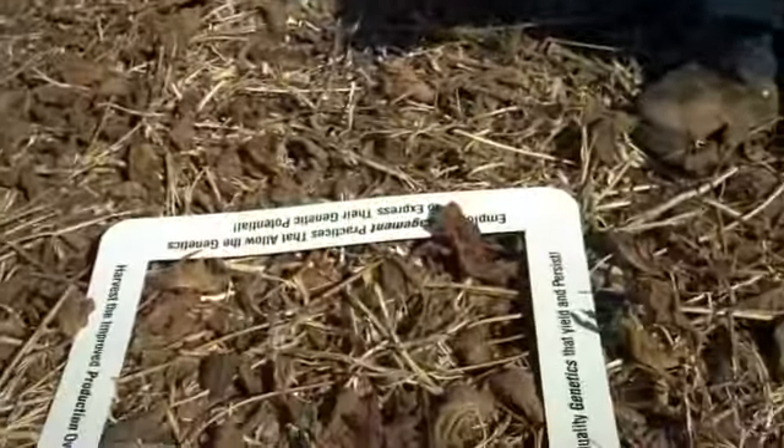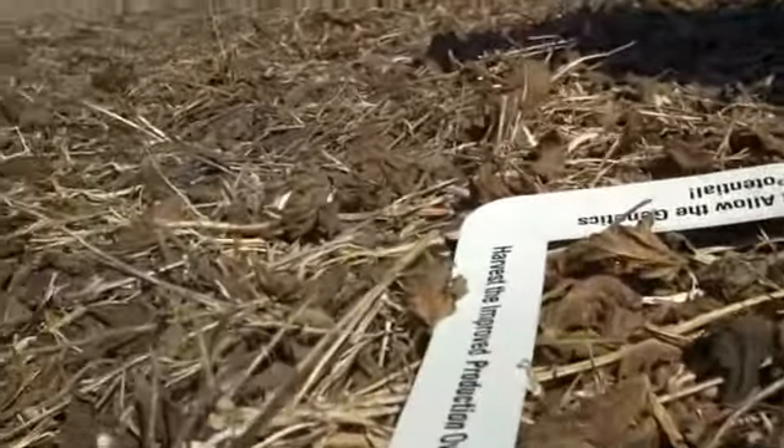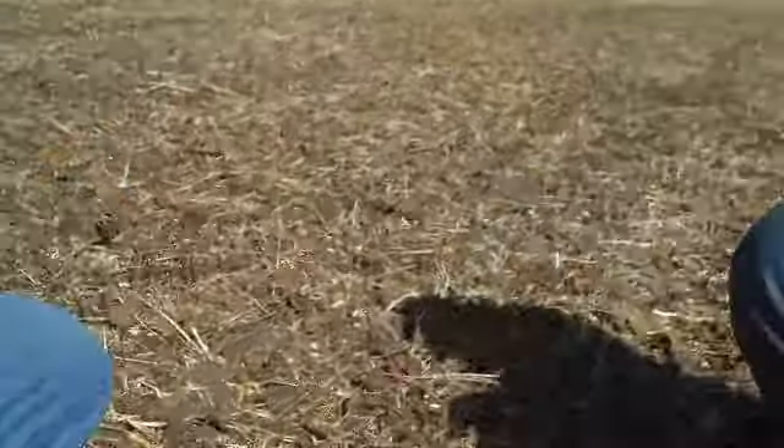Now Dusty, there are some guidelines to also be concerned about and remember with your combine, and where the head loss or the threshing loss could come from, and some university information on what's acceptable. That's true Mark. Probably what I always focus on is the three key areas: you've got your pre-harvest loss before the combine hits, you've got your header loss, and you've also got your loss throughout the back of the combine. Take all three of those into effect.